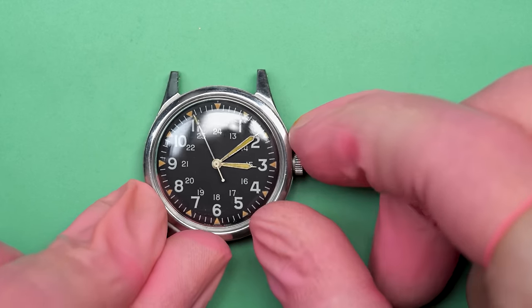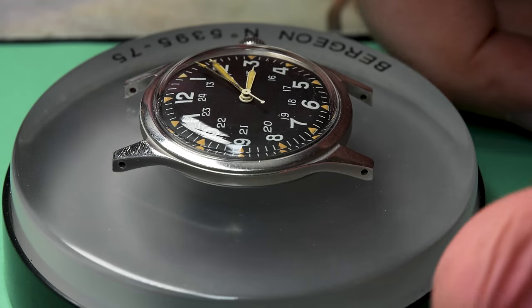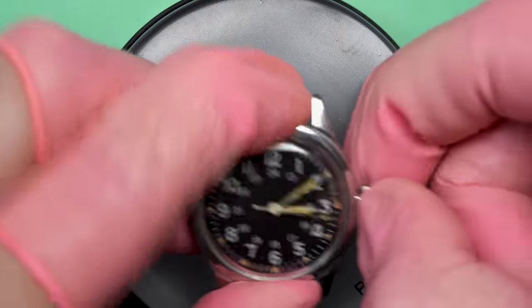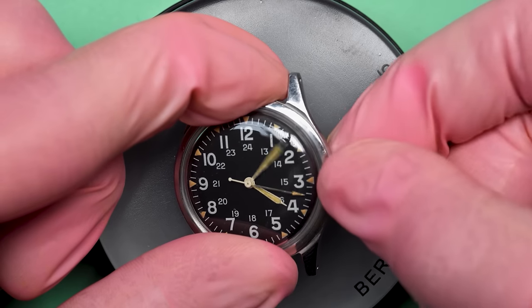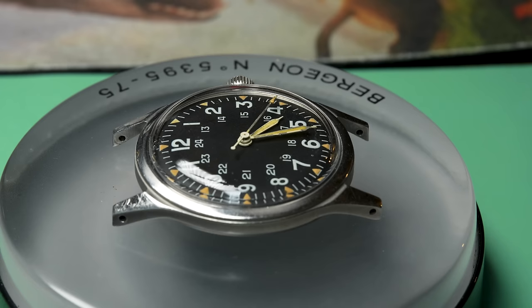All I have to do is tighten down the crystal from the outside, make sure it's engaged with the case, and once it is, I can unscrew the jaws and the crystal will just expand into place just like that. Take a look at the hands — they look pretty good. Not perfection, like it's not 10 out of 10, but it's like an eight — they look much much better than before. And I don't think your eye would naturally go 'that doesn't look right.' They're close enough that you'd think, yeah that looks fine — you wouldn't assume those have been re-lumed, which I think is really great.